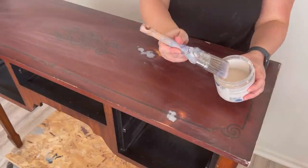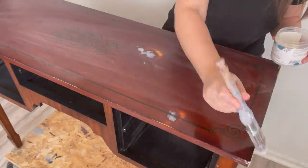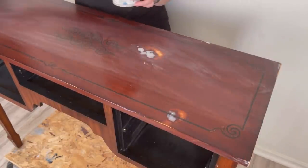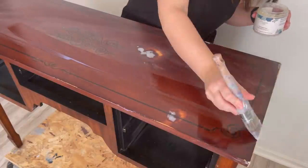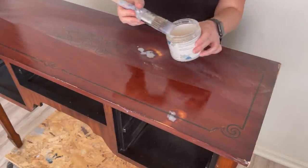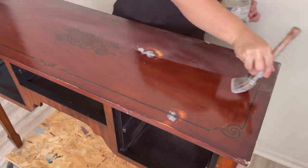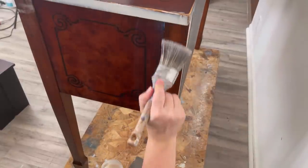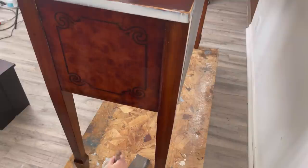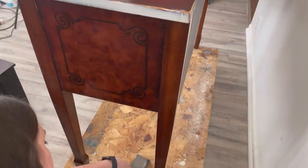Because this isn't a real wood piece and the surface is really shiny, smooth, and slick, I'm going to use Country Chic's Clear Bonding Primer. This bonding primer is amazing — you only need one coat. It goes on so smooth with no streaks, no brush strokes. It's a thinner consistency. I apply one coat to the entire piece and wait about 12 hours before applying my paint. This guarantees that my paint is going to stay on for a really long time — years to come — and I don't have to worry about it peeling or sand the piece either.